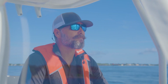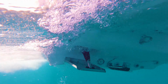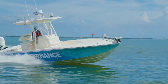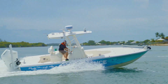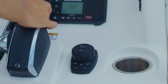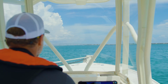The Pro Control Auto system consists of three main components. At the stern of the vessel are the trim tabs, fitted with best-in-class SD Pro Smart actuators. On board, you will also find the Pro Control IMU puck. This device senses changes in vessel dynamics such as pitch, roll, and yaw in real time to inform Pro Control's auto-leveling software. Finally, at the core of the system on the helm is the Pro Control Auto keypad. The keypad allows for automatic and manual operation of the system, as well as commissioning and diagnostic functionality.